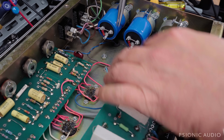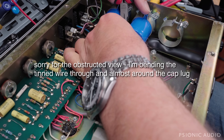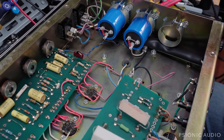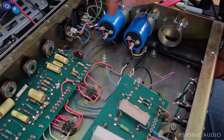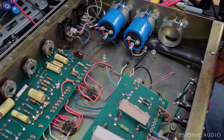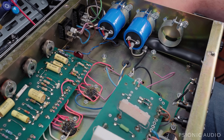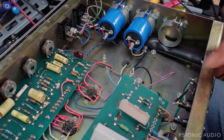Let me get this ready to do that first. Notice that there are no solder joints yet — these are held in place mechanically. I'm going to solder some of them and leave two unsoldered so I can do the wire from here to here, which will put these caps in series with each other. Now I do have a decision to make. I've got these large resistors here on the board.